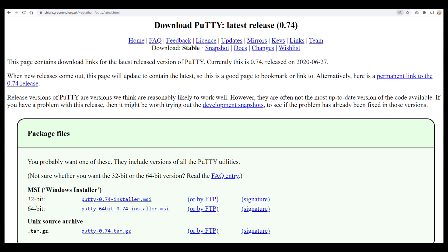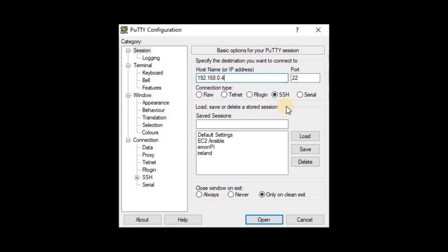To use this mode, you will need a terminal emulator program. I'll use one called Putty. When launched, it prompts for the connection details. So we select Serial and enter COM4, which is what we noted earlier when we programmed the controller, and the speed, which is 115200.